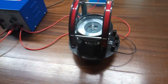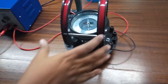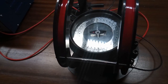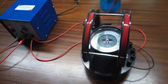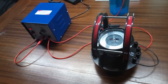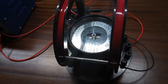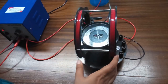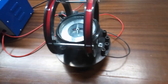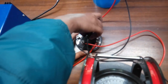The deflection of the galvanometer should read 45 degrees. To make the solution more conductive, you can add a small amount of H2SO4 to increase the conductivity of the solution. In that case the current flowing through the coil will also increase and the deflection angle can be adjusted. Make sure that the deflection is 45 degrees — we can assume this is the deflection for direct current. Note down this current, then switch off the reversible key.